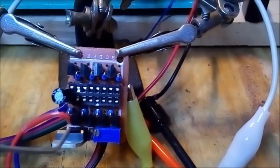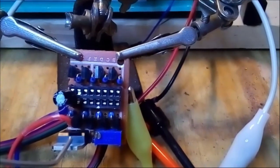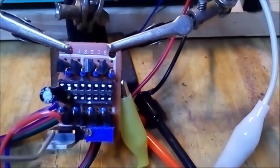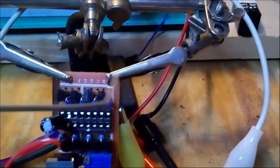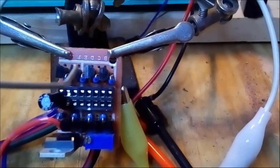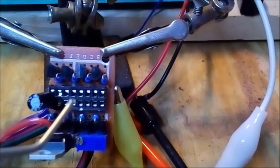Remember, the LM317 is limited to an input voltage of, roughly speaking, 35 volts DC, okay? So don't go over that. And in any case, it's rather senseless to put in that much voltage, since that sort of display over there will never use more than 6 volts DC, okay? And anyway, I planned to power it with my lithium ion battery, which only gives about 7.4 volts. Well, actually 7.5 volts, I mean, when it's fully charged.